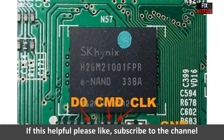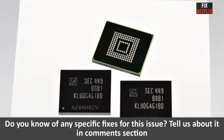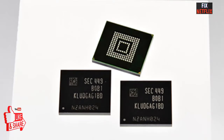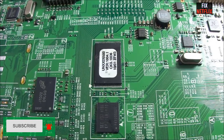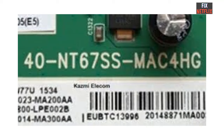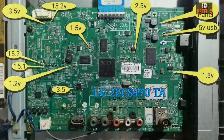The main firmware is normally stored in NAND flash or eMMC flash memory. If you suspect a bootloader problem, try to upgrade the board firmware and check the result, or use a universal programmer to reprogram the bootloader flash memory with a good firmware. Make sure to back up the original firmware first before doing any read or write operation. If reprogramming still does not help, replace the serial flash memory IC with a good one and write back the firmware.